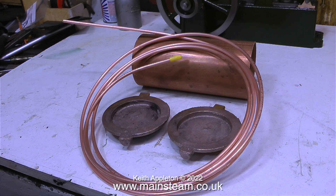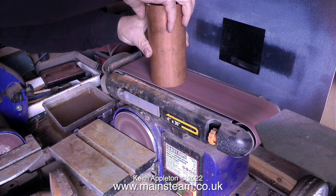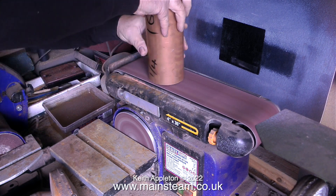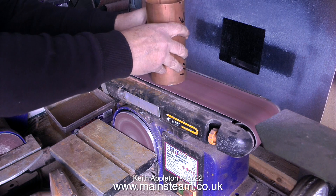The components are a piece of copper tubing, two end caps, and a coil of copper pipe. The first job is to square off the ends of the copper pipe. I could do this in the lathe, but it's quicker and there's less chance of disaster on the belt sander — if I put this part in the chuck it will overhang considerably and may foul up when I start cutting.